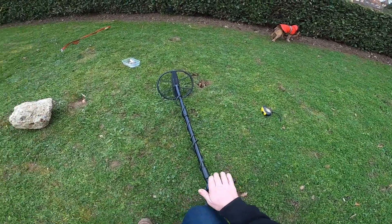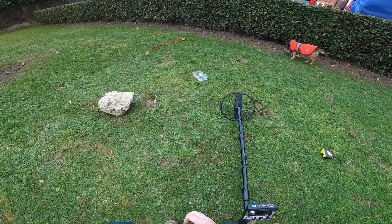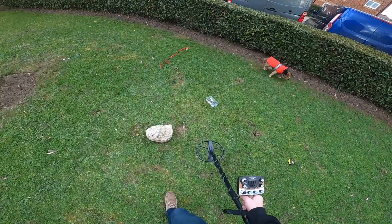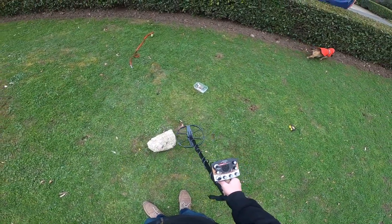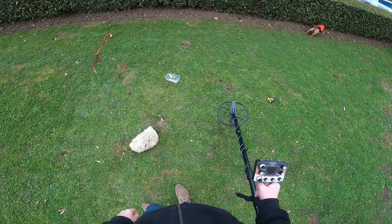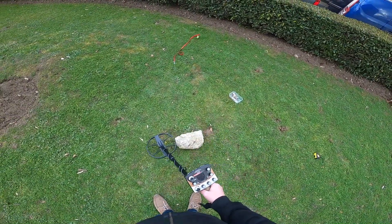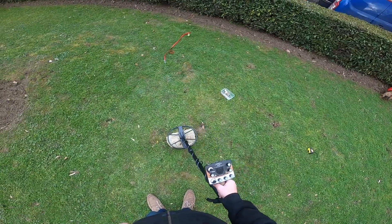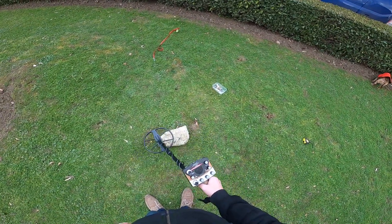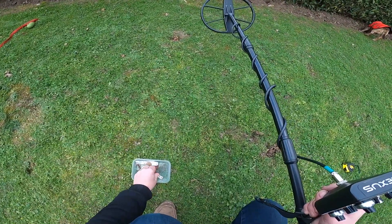Magnetite — if you've got a mineralized rock in the ground in your field, how do you know? It produces an inverted phase signal. When you swing over it, it won't detect the magnetite or the heavily mineralized rock in the center of the coil. Watch — either side you can see you're getting a hit. Out in the field you could get confused and think you've got a signal.